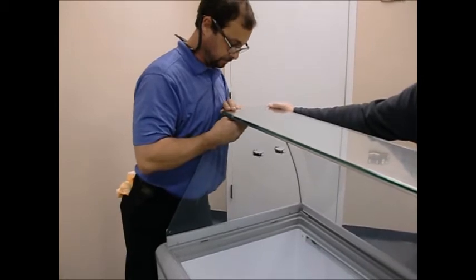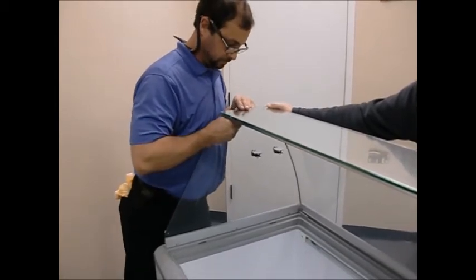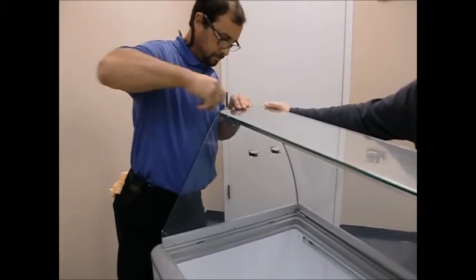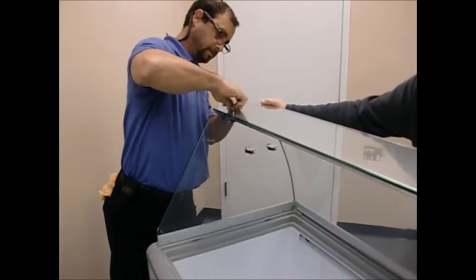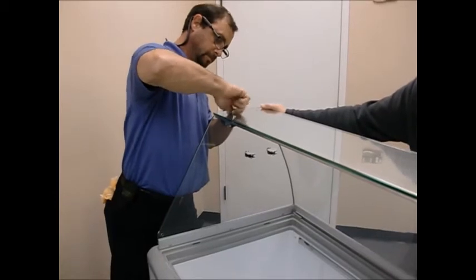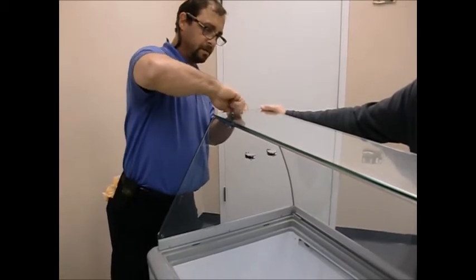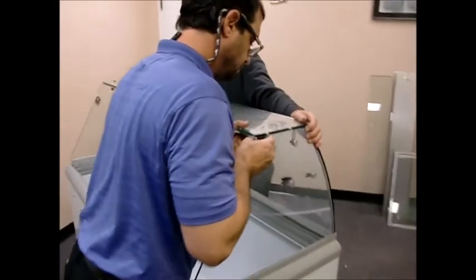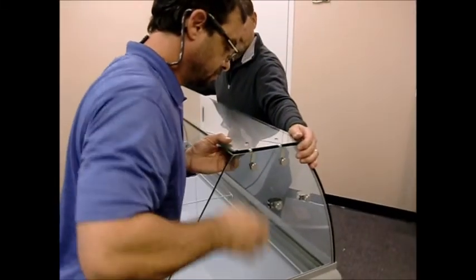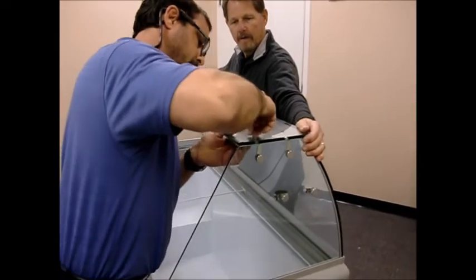The top pieces should now be secured to the L brackets. Begin by threading one of the large flathead bolts through the top hole and into the L bracket. Tighten by hand. You may need to wiggle the glass a bit to align the holes, so the second person should keep firm grip of the assembly. Now repeat the step on the other side of the case.